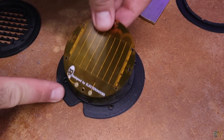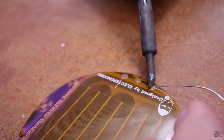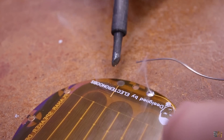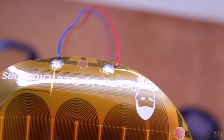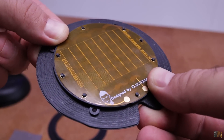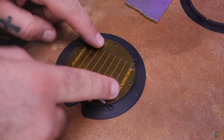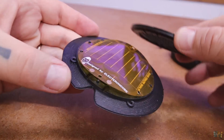It's made to work with 7 pairs of magnets. Solder wires with a lower temperature and faster than usual because these PCBs can't handle the soldering iron for a long time. The PCB has 8 holes all around for support, and those will go on the 3D printed part of the design so it will be held tensioned.